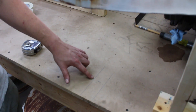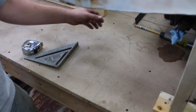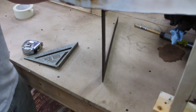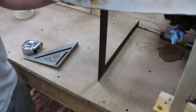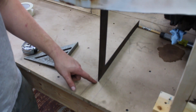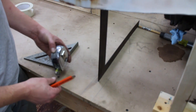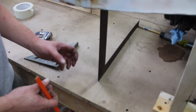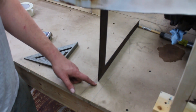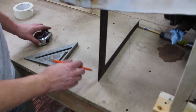In the front, it's a two-inch tube, so it's 28. I just took a square to figure out where the tube is going to sit. If I put the tube right up against the body inside of the body shell, it'll be right there — that's three and three-quarter inches in from the edge of the table. I don't want to put a fillet weld of tube right there, so we'll go about a quarter to three-eighths wider. That'll put this line at three and a half.